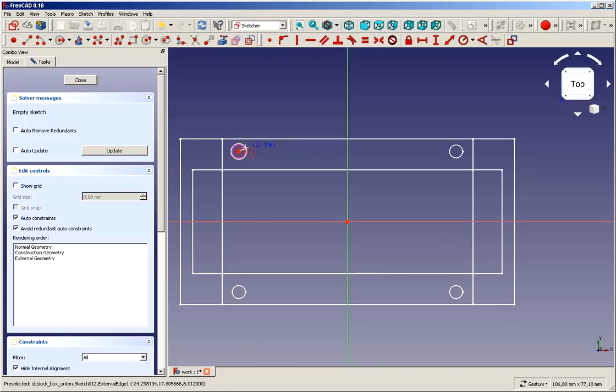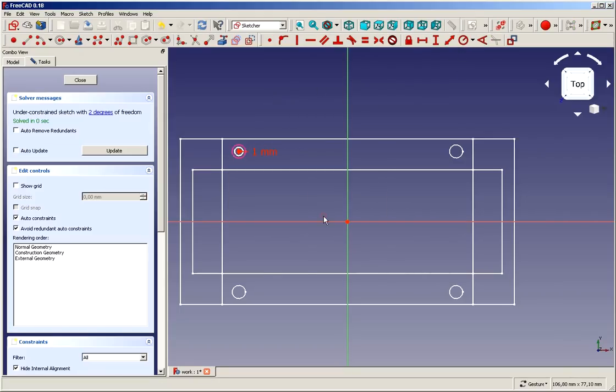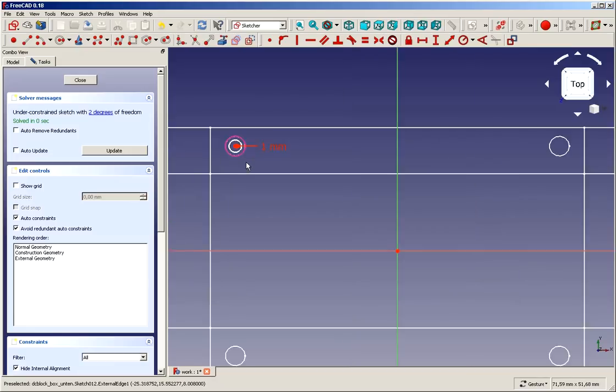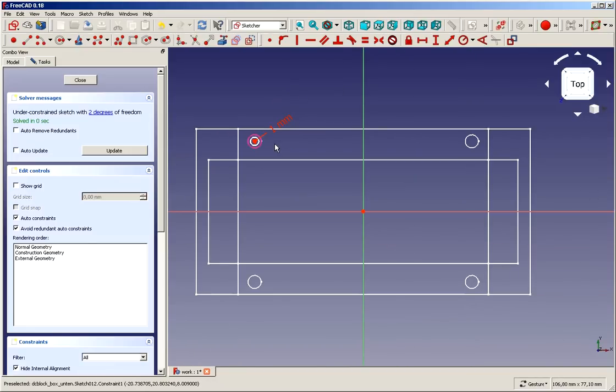create one hole, make this hole a distinct diameter, and I'm taking 1 millimeter, so it gives me a diameter of 2 millimeters from 1 millimeter of radius, and that gets a little bit smaller after the print, and it's good for putting in a self-cutting small screw.